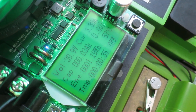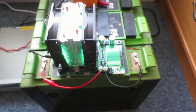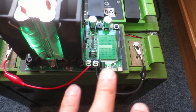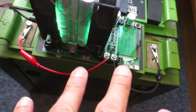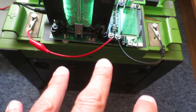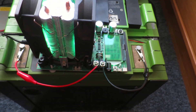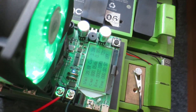You can see it's used 1.1, 1.2 watt hours. It also has settings that allow me to tell it when to stop. I've got this set to 30 volts — when the battery gets down to 30 volts, which is about 2.5 volts per cell, it will cut off, stop dissipating, and beep to tell me it's finished. I can then come here and record the values.